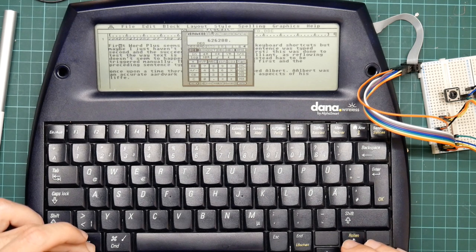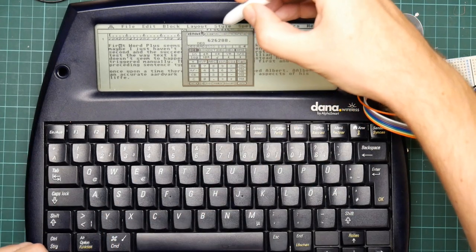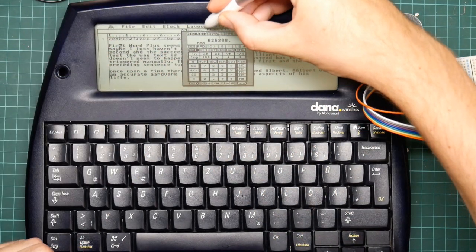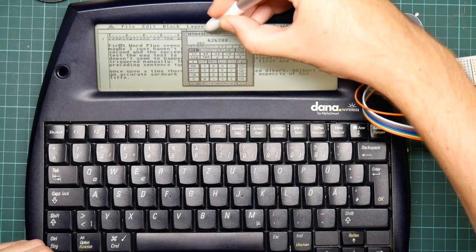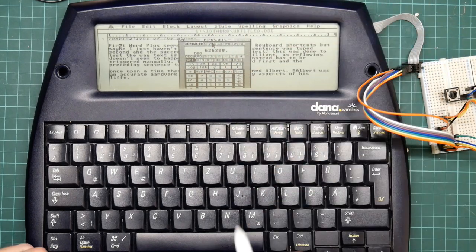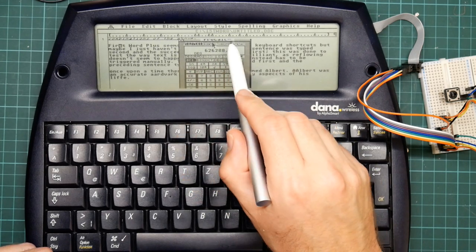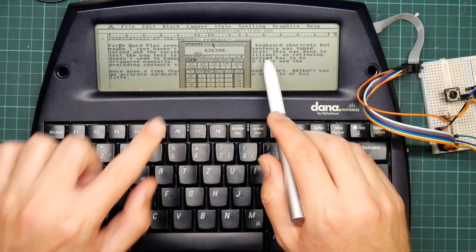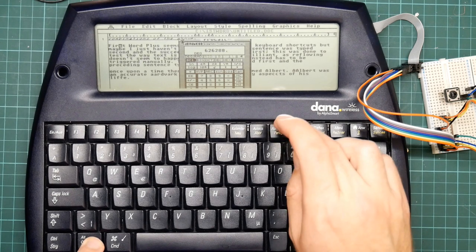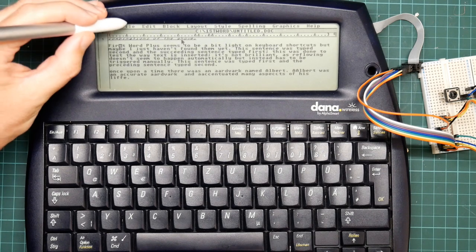Yeah, it's a perfectly ordinary calculator. You notice that the title bar is slightly off the top of the screen. Again, that is an issue with the screen size. You see how the window doesn't quite fit. Now, if I can manage to drag this... Come on. There we go. See? It has truncated the title bar because it's moved the window by just blitting it around in the video memory and hasn't redrawn that bit. You can trigger it to redraw and it will show up again. It's just cosmetically annoying.